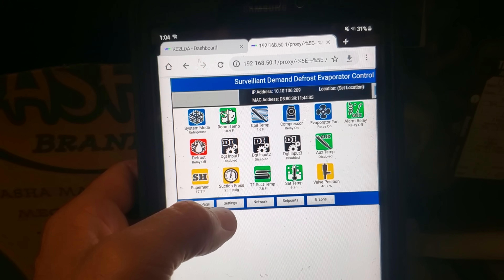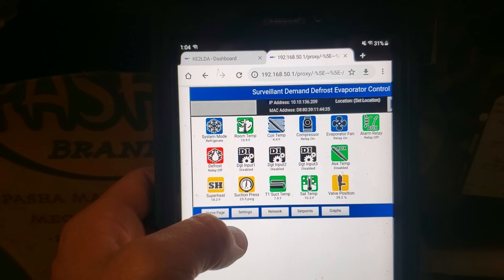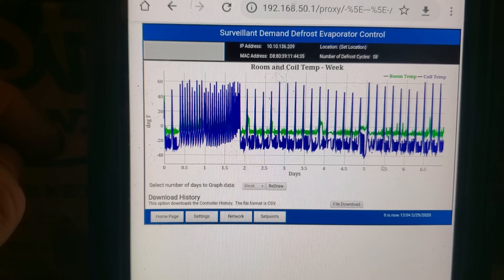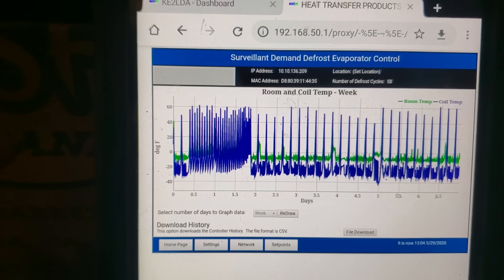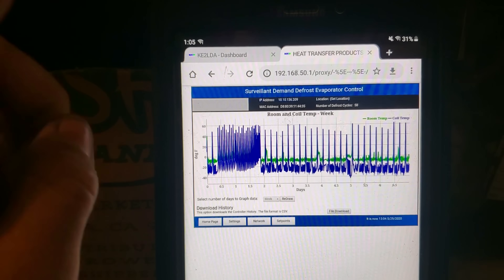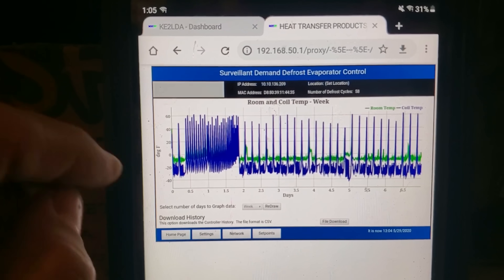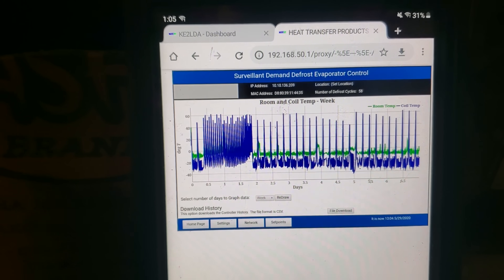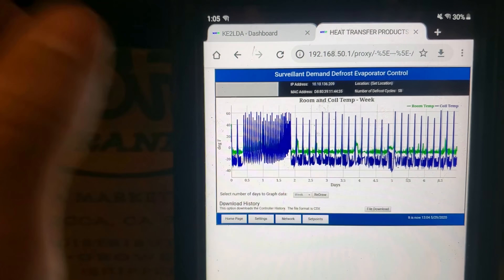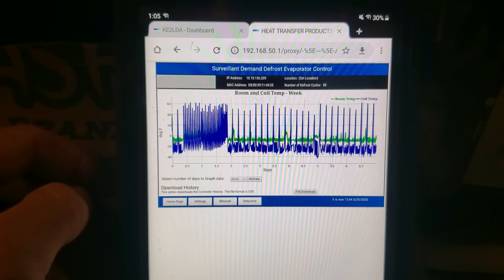Coil temp — I don't see anything very scary. Superheat's a little high right now, but let's give it some time — it's still trying to pull down. Let's look at the graph. That's a lot of defrost — it just kept going into defrost. Usually on these smart evaporators, there's some sort of an algorithm that looks at the difference between the room temp and the coil temp, and I believe that's how it goes into demand defrost. Typically when we have this problem, my experience is that it's a bad defrost sensor or bad coil sensor — air sensor. The room temperature sensor doesn't look to be bad, but the coil sensor looks a little funky. Anyways, I changed them all. Usually that solves our problem. We're going to watch it. We've also got to jump up on the roof and put some gas in it.